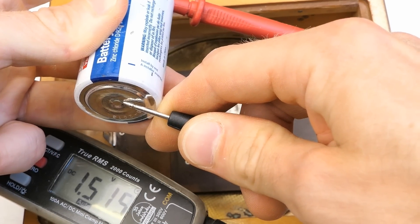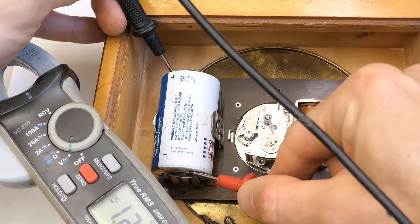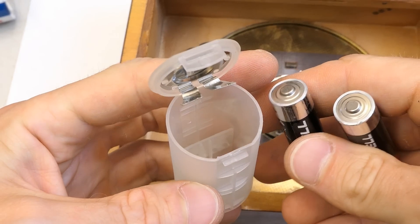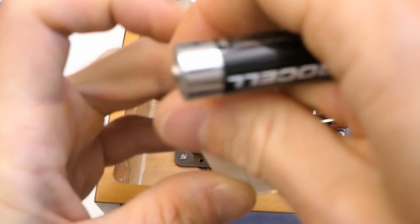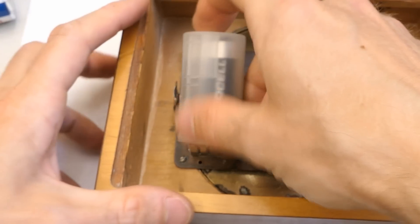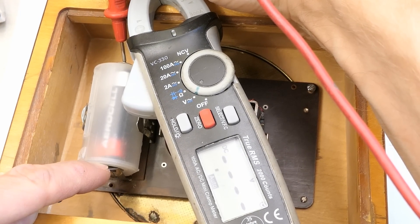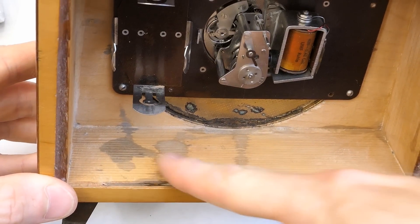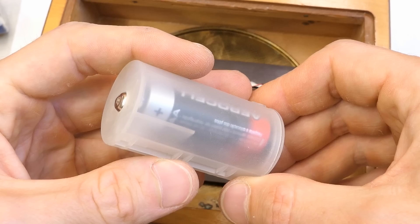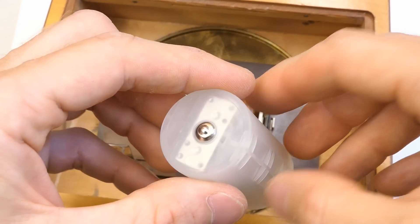Is the battery too weak? Let's measure it — it's 1.5 volts. And when I insert it, does it pull the voltage down too much? Let's measure on the battery — it pulls it down to 1.3 volts. It seems most of the voltage remains on the battery. But anyway let's also try this 2AA-to-D-cell adapter — you put 2 AA cells in it and it turns them into a D cell shape, very cheap from eBay. And still nothing — there is still about 1.3 volts going into the clock. Of course in the history of the clock some batteries leaked into it and you can see the marks from it. Leaking batteries are horrible. Not only does this adapter allow you to use more common AAs than obsolete D cells, but having the batteries in this thing makes it less likely to leak into the clock — you still have some chance that the leaking liquid will stay in the adapter.